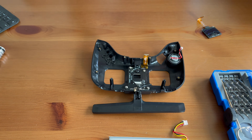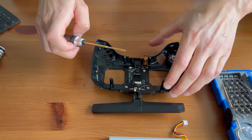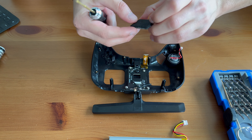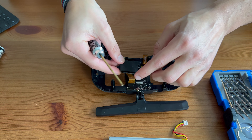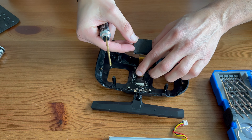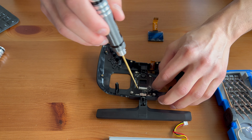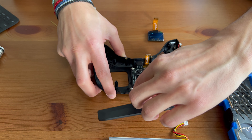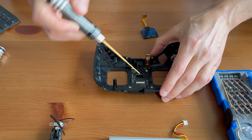As you can see, this is the PCB board — this is version 2, and you can see the version number located here on the side. We don't really need this now, so we can set it to one side. The screen would be underneath here. When pulling it, the screen was situated like this — it came through the hole and was fed through like this, so you have to pull it gently. Don't pull the black connector off — that's not what you want to do. First, take off the aerial using the 1.5 millimeter and unscrew it.